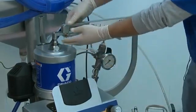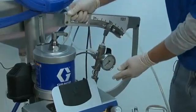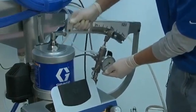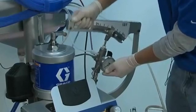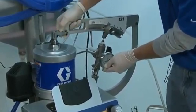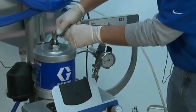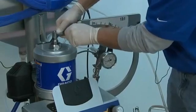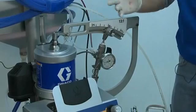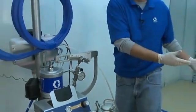To prime the catalyst pump, we want to pull the pin and pump it. We only need to pump it to 300 to 400 psi. Once I've got the proper pressure of 300 to 400 psi, I want to re-pin my catalyst pump. Now we are going to go through proper spray pattern calibration and glass pattern generation.